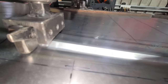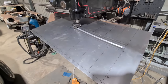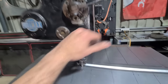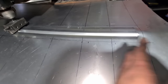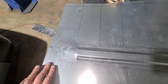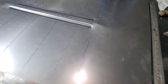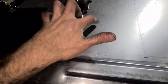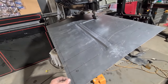I used oil on this run because I actually care about this piece — this is the actual floor. Much crisper and nicer pass. Instead of just going straight to max setting, I just gradually bumped it up and did about 10 passes across here so it's nice. I've tried to contain some of the swelling as I go with the mallet just to see if it makes any difference.